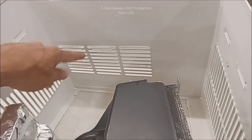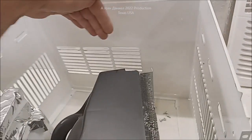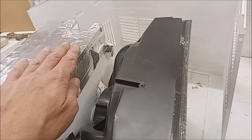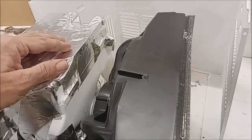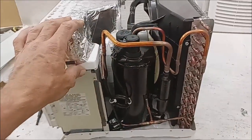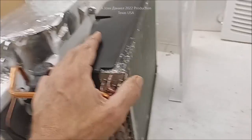One of the things they have is this ducting system on the top, and what that does is creates unnecessary turbulence. But if you put a dome or a scoop - like a hood scoop on that - it increases airflow. I have done this test with a watt meter and dropped 7 watts of power, because everything that restricts that fan is power loss. A dirty air filter, this being plugged - it's all power loss. Over time, when you get the sticker that says it's going to cost you $62 a year, it's going to cost you $90.